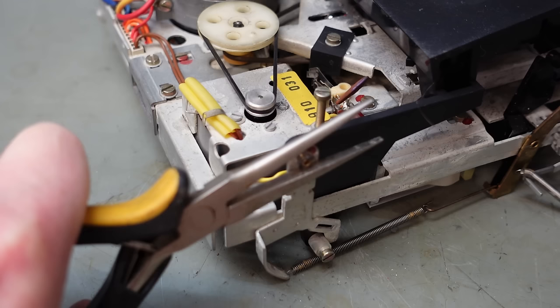I can't see anything else fundamentally going on with these. So that's a normal play direction. And this, yeah, it's quite light. Little bit of friction, which is what you want, just a tiny amount. Go the other way. So that feels nice and loose on there. I notice this brake pulley here. It's a bit wobbly. Look at that. Let's undo this cover. Take these springs off.